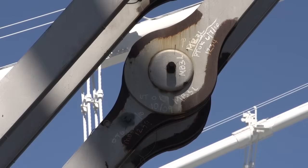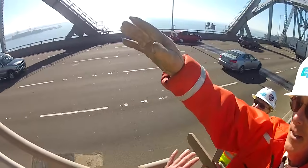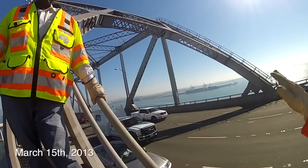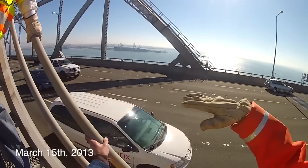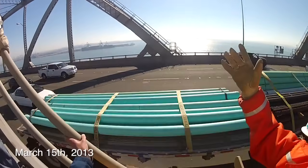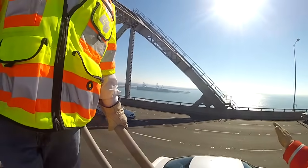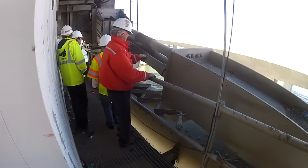Maroney has been planning the demolition for years. He points out the structure: this is a portal — all the steel that's up high is called the canopy, that's the top chord. The portals are the part you drive through. The portals at the beginning and end, the portals uprange, are always the biggest, largest, strongest, and stiffest. They carry some of the load from the top down. Maroney was taking engineers to one of the first sections that will be dismantled.